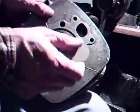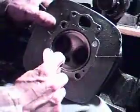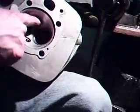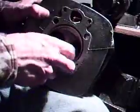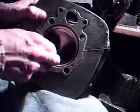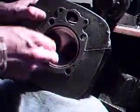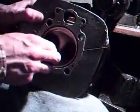This hemisphere on this titanium blade — I'll call it — will take out those ridges that are left from the factory machining when it's done. You can see one right inside there; there's one right there that we'll take out. Using the sharp edge of the water jet cut titanium blade here, it's just a serrated sharp edge basically on a micro scale, but it scrapes aluminum really well, pulling off the curls of this aluminum — a very small amount.